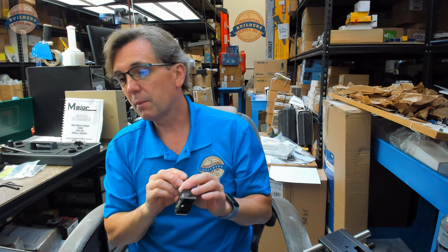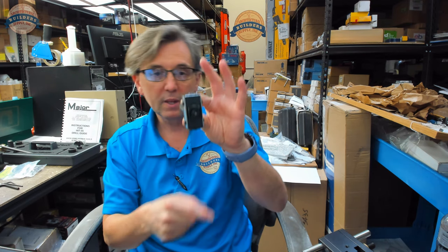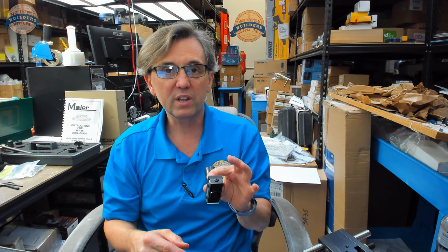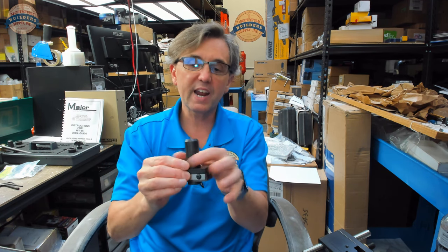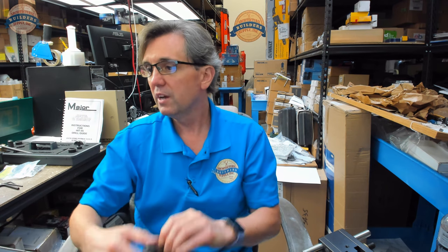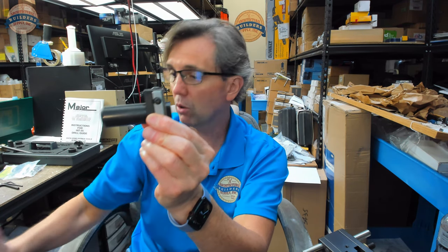And what the factory recommends is use a combination square to mark a horizontal line so you can line that up. You don't want your latch bolt prep to not be perfectly vertical. So people will get that on there and they'll just smack the daylights out of this to impress yourself that rectangular edge. And then, well, we're getting ahead of ourselves. So I showed you how to mark it, 1-inch hole only.